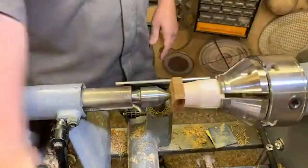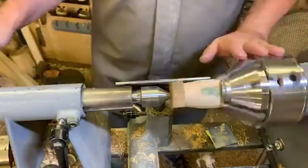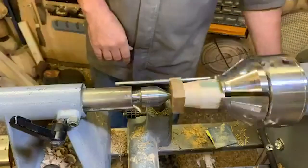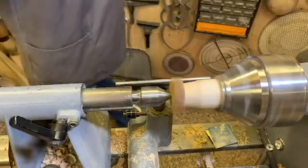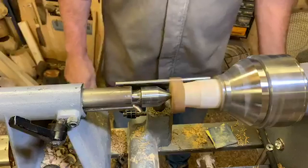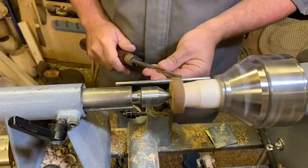Are you using the AT406 lathe? I'm using an AT406 lathe. Yes, I am. In old money, that's a 1628. Okay, so let's get this rolling. So I'm going to do the wheel, get my glasses on, of course, safety specs first. Turning here at around 2000 revs is going to be nice. I'm turning a square at the moment. The size is the same size as the drive.